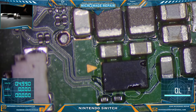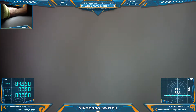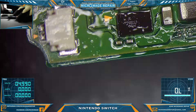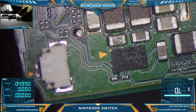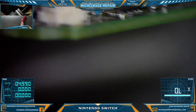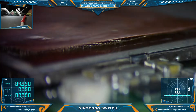I'm going to hope that's good enough. We'll check it afterwards, but right now I'm going to do a rapid cool. It's got a big ground plane directly on the other side of that chip, so it takes quite a bit to get that thing flowing. All right, that's clean. I'm going to power up my air compressor off screen and give this a good blowout, directing some air under the BGA to get most of the flux out. We'll be back with a test. Let's get a good visual on the chip — the corrosion is gone — and hopefully that will solve our problem.